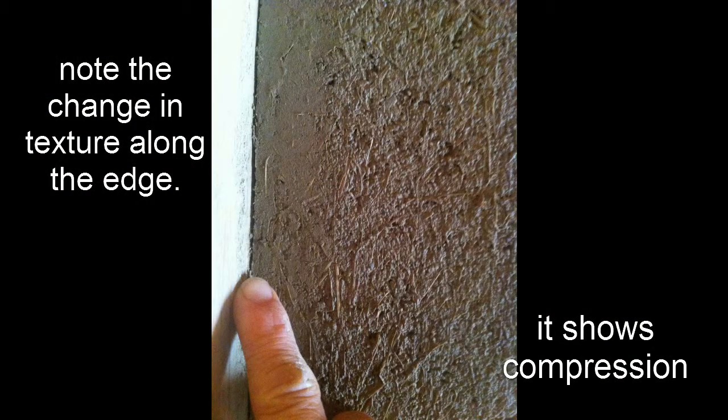On a recent job site, I was reminded of the compression technique. This is a way to avoid the voids by compressing the edges of the shape coat. The shape coat is what Rebecca Tasker calls the coat between the straw bale building's base coat and the finish coat. I like this sensible term.